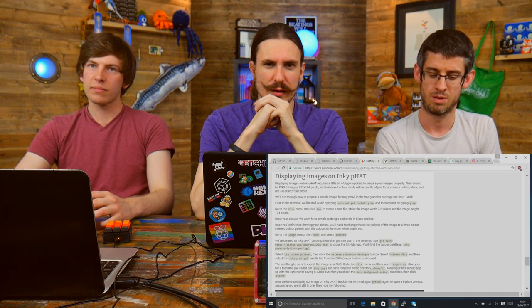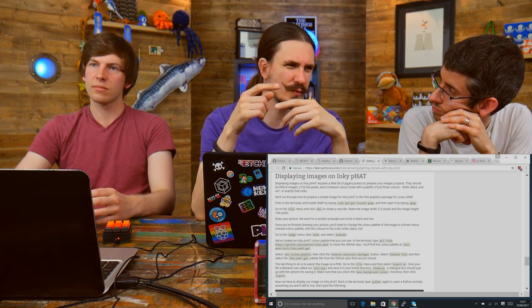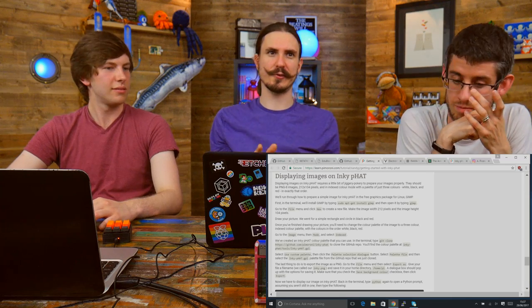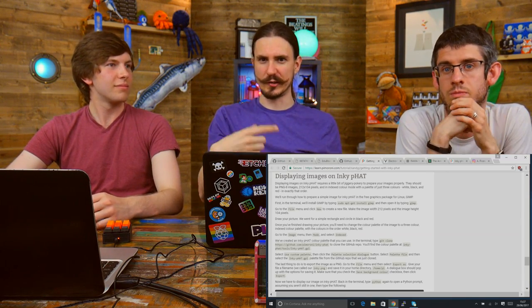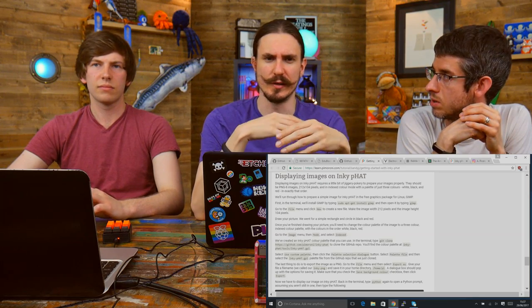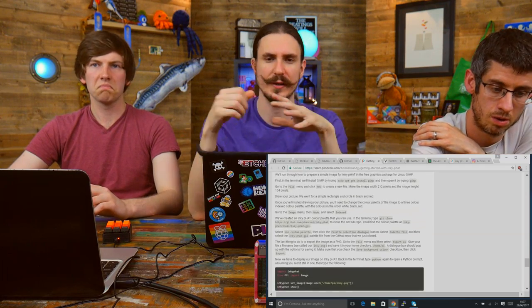You could effectively do that, but it takes so long to refresh that you're only going to get reasonably two frames every minute, I guess? Because you want to display the frame for at least as much time as it takes to refresh it. Otherwise you're basically just going to be refreshing constantly. But yeah, you can, no reason why not. You can write a frame buffer driver in Python. All it has to do is create a little device node, and then you just fire information at that in a predetermined format and grab it out and display it on the screen.